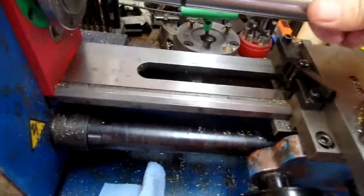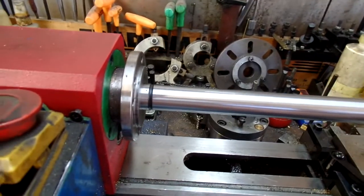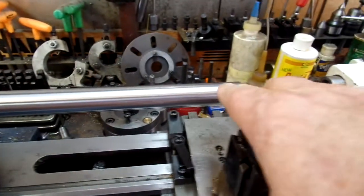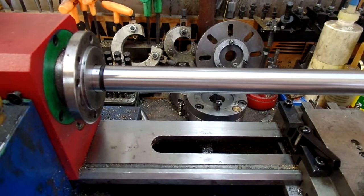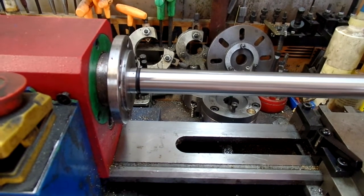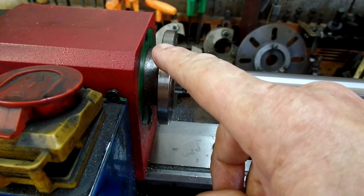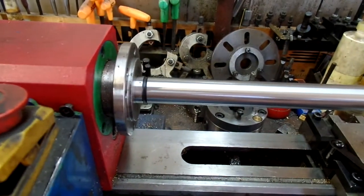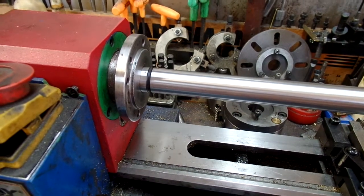It's got some issues, but by mounting an indicator here and checking at this end and comparing the readings you can get really close. My particular setup has a defect in the spindle MT3 taper, and possibly the bar is just a little bit out of line too — but what do you get for sixty bucks shipped from India.